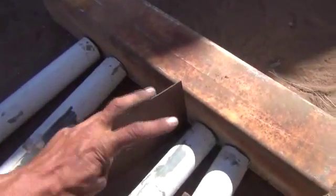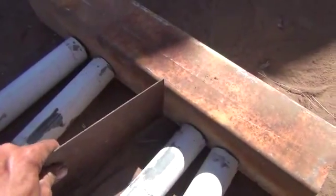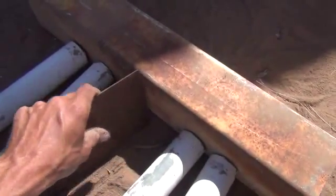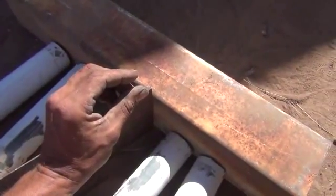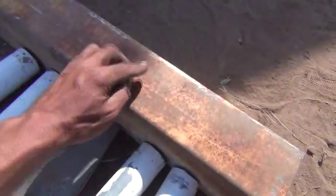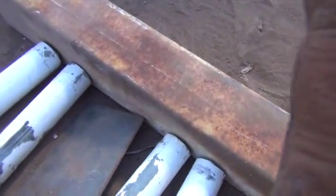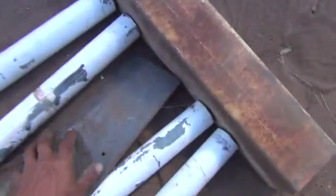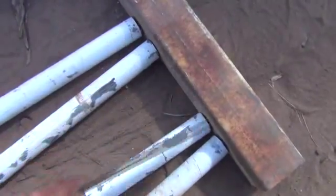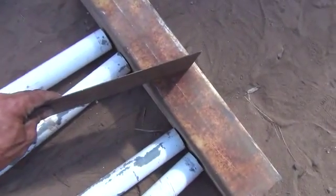This piece here — let's say this direction is top, that would be bottom. You want this piece in here slightly sloped downhill as your divider towards the back side. Then you're going to leave either a couple half-inch holes or a quarter-inch gap right there at the back. The biocrude that comes out of these two pipes will naturally hit that slope, go against your gap, come down through, and hit the bottom where we're going to collect it out of both sides. You don't want the gap at the front side — that will put all your biocrude right in front of your pipes, getting more of it back into the smoke. You want it to run down the back side at a slight slope.